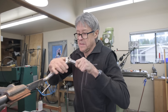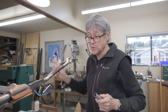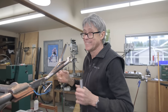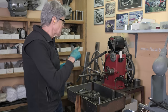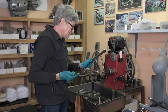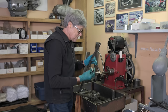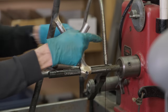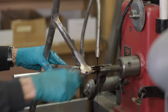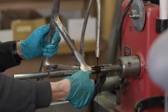And it's a no-go, so this has to be honed. I'm gonna set the hone up. We're gonna hone it and then slot. Okay, I'm on the hone here. It's a pinhole grinder, a Sunnen machine. When I started working in machine shops when I was 18, first machine I used. So this turns around. This is the oil, honing oil. Let's see what happens. See if I got this right.